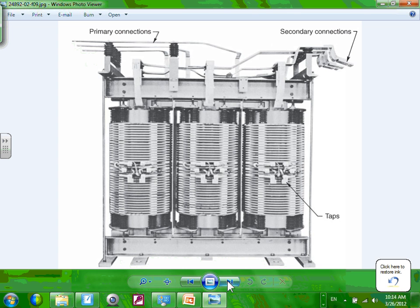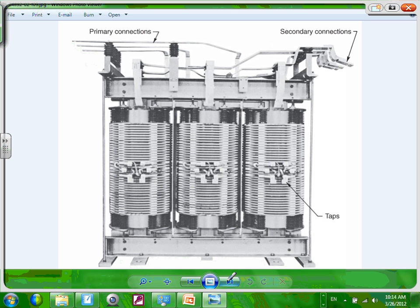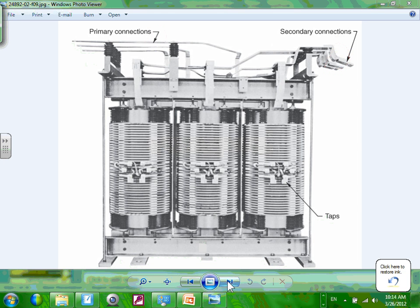But the concept is always to get you a transformer. This is a really nice way, guys, of showing you inside the substation. Can you see, Chris, how they bus them? Look at the buses, copper buses. They're busing out of the transformer. No cables, nothing. They're all copper or aluminum buses. Obviously, we don't size this. It's sized by the manufacturers of the unit substation.